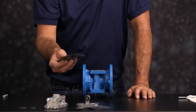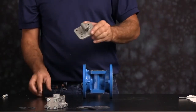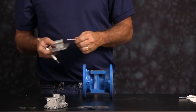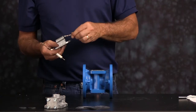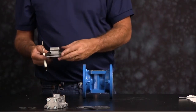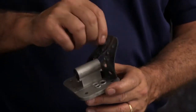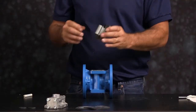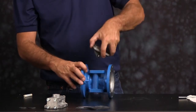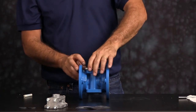Now install the pilot valve. Push the actuator plungers out of the way — make sure you do that. Our pilot valve is pre-lubed; pop the spool out and just check it to make sure there's a light amount of grease on the O-rings. The pilot valve gasket goes over the mast on the pilot valve. The pilot valve can go in either direction. Just make sure that the actuator plungers are pushed out of the way and that the pilot valve is not sitting on top of them.